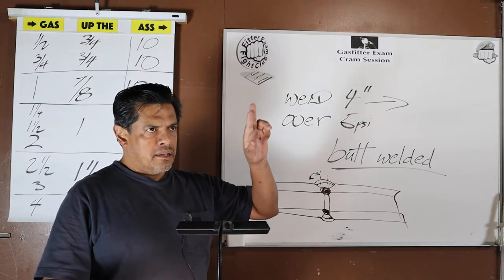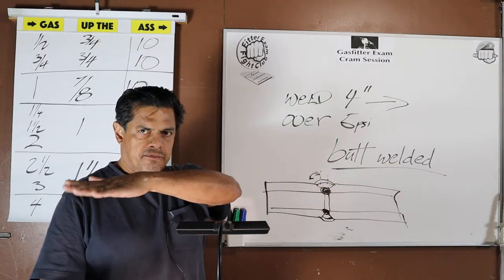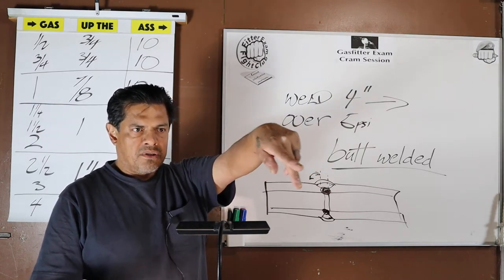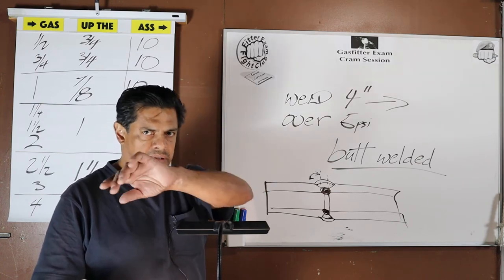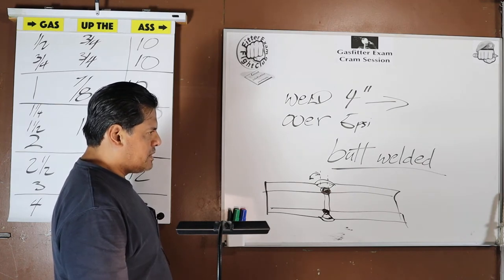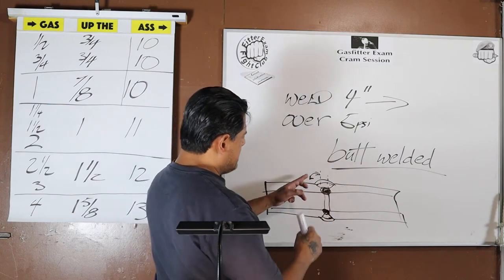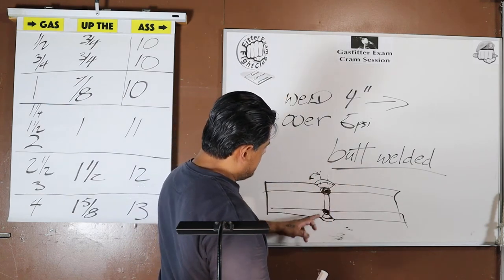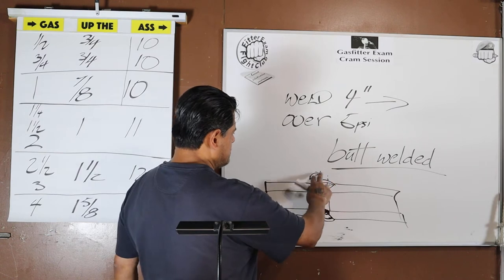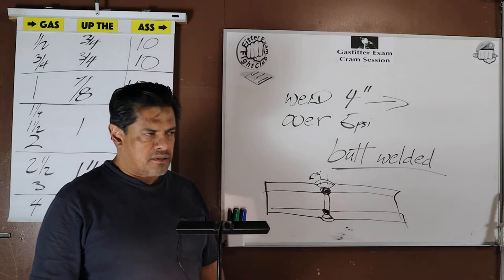If he's good, his little ripples, it should look like a little stack of coins. You got a stack of coins and you laid them flat, and it's just a nice uniform semicircle upon semicircle. It's supposed to be very pretty. Okay, I remember helping welders who, like, some of them were absolute artisans. Like, you'll have spatter and everything. He would take his file and he would file right at the edges of the root, get all that spatter off, shiny, shine this up. Gorgeous, gorgeous work. You know, never fail the x-ray.